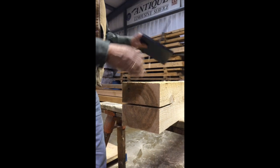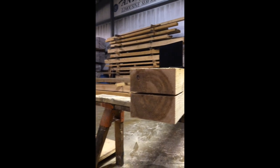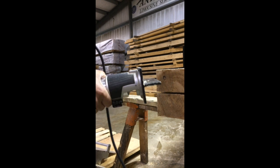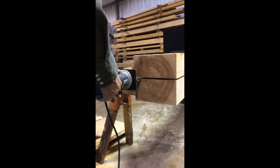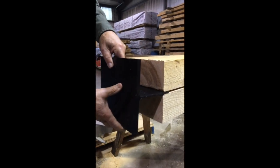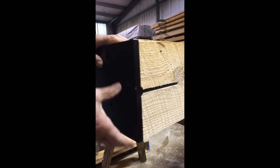The way we do that is with a little laminate trimmer and a special adapter plate that fits on the Makita router, which allows you to cut the chamfer on the mouth of that slot very quickly and easily. You can see there's a slight chamfer now, which allows the T-Rex to go all the way into the beam right up even with the end grain.